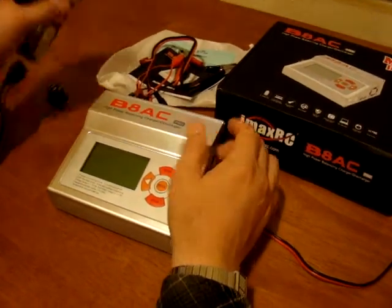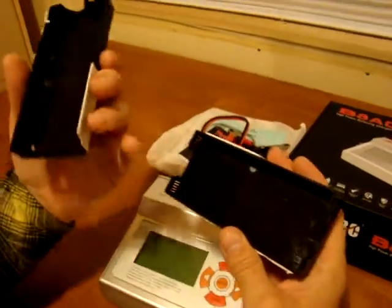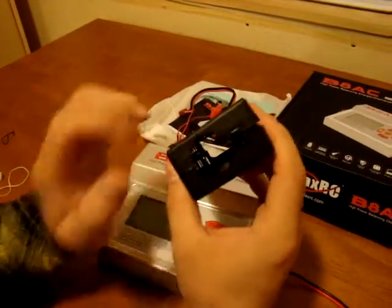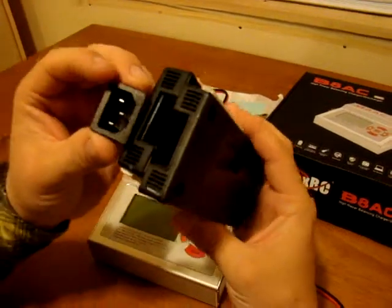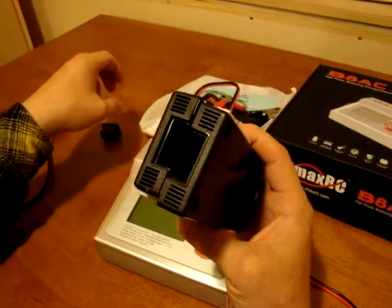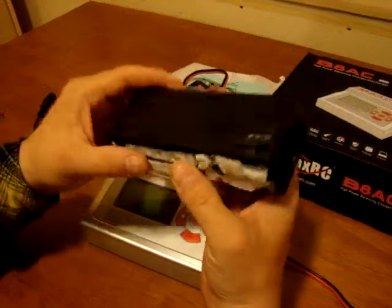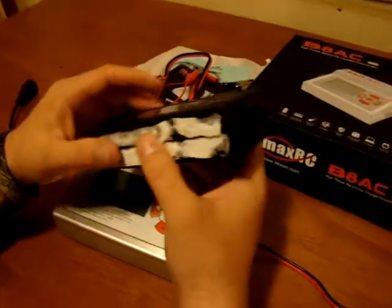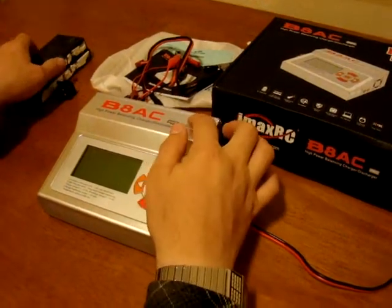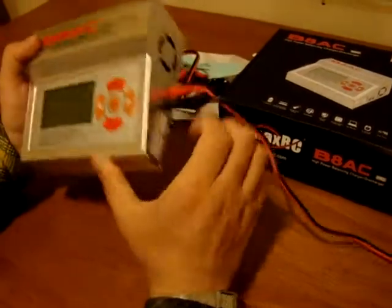When I opened it, there's a power supply that looks like a laptop power supply inside a case. The power supply — I cracked it open, pulled out the board, installed it, pulled out the plastic shelf. They did put a cooling fan in there, but when the connectors are there, there are pretty much no ventilation holes except those little ones and it doesn't do a pretty good job. Basically I took it out, attached it with double-stick tape, opened the charger, pulled out the power supply, cracked it open, removed the board, installed it inside with the cooling fan and everything the way it was before, and now it's up and running like it should be.